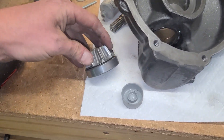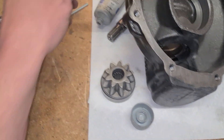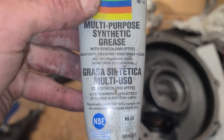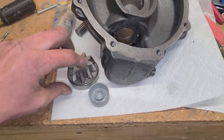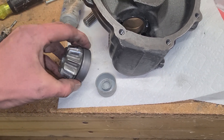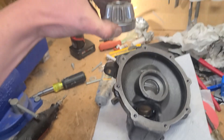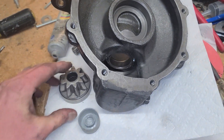When it's put together, it looks like this. To put it back together I am using Super Lube synthetic grease — I love this stuff for just everything. You can use it for brakes, it's dielectric, food grade, clean, heavy duty. You can use it for light bulbs, you can use it for a lot of things. It's probably best to lubricate it with some Hy-Gard since that's what goes in here, but a little bit of that grease is not going to hurt anything and it is a super light coat. Now I'm going to put a light coat around this bearing and attempt to slide it into that recess. Trust me, if you are off by a millimeter — if you're cocked a millimeter — it won't go in. It'll freeze. These things have very, very good tolerances.